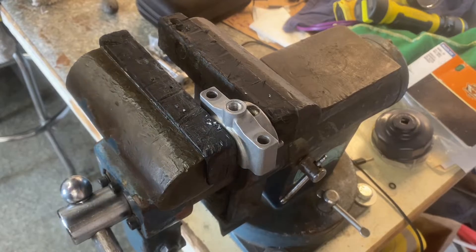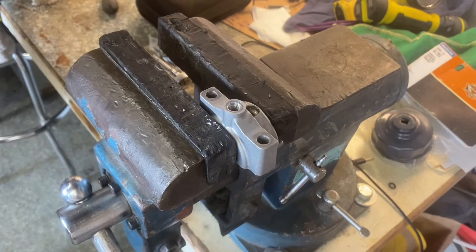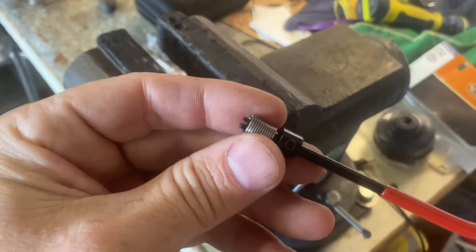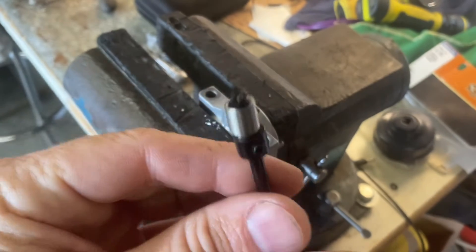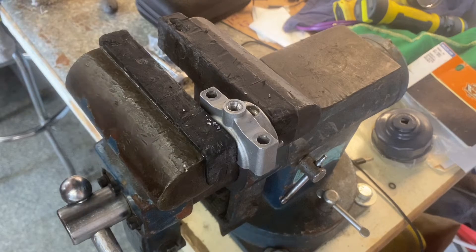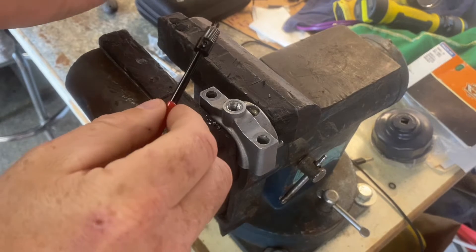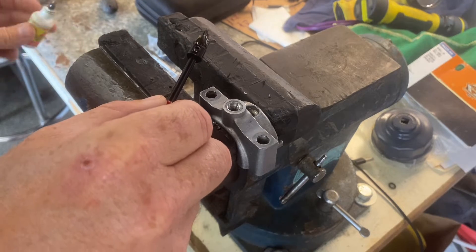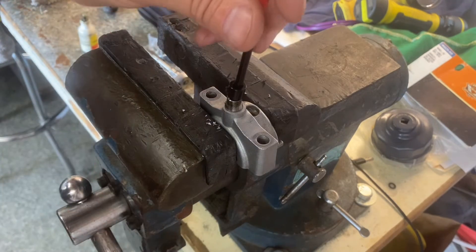There she be — drilled and tapped. I cleaned it out with some no-name brand brake cleaner and blew it out with the air compressor. Now here's our little insertion tool. You can see it's got this slot in it — it goes right into that little tang on there. What I like to do on these as well is put a little bit of thread sealant on them. I thought I had some red but I've got this green stuff — any of it will be better than none of it.